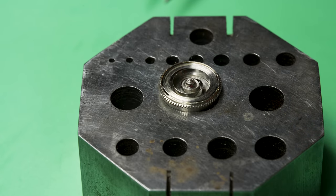But this is the part I was talking about — I need to let down the mainspring again. The most difficult part about working on an older watch without shock protection is properly oiling the balance. That balance jewel is the most important one on the whole watch — it's under the most stress and oscillates literally thousands of times per hour. So I have to completely disassemble the balance. First, I use my very smallest screwdriver — the orange one, half a millimeter — to take off the balance wheel.